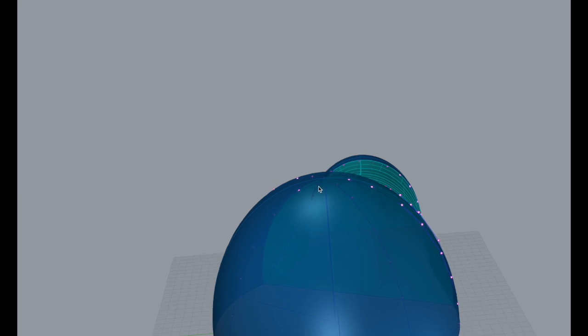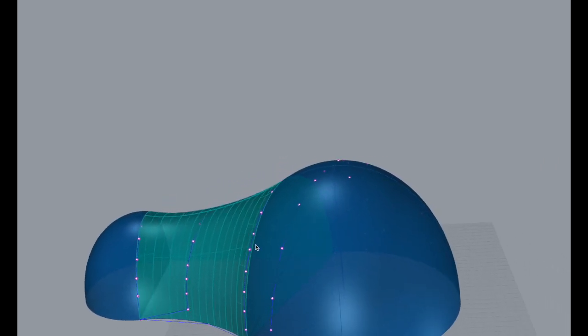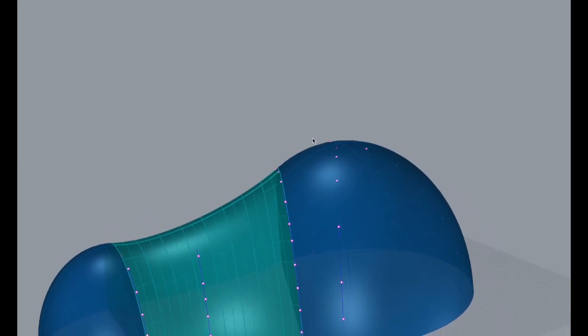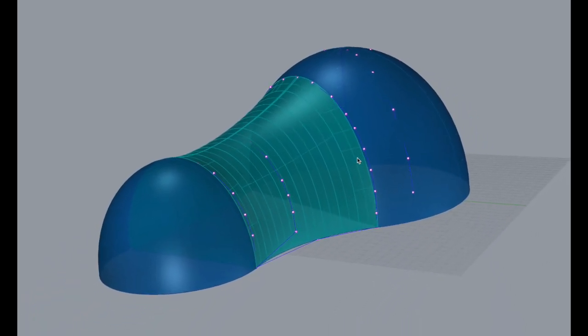So the top came down a ways and went kind of round. But then, here at the saddle connection, it really came down. So, yeah, it's exactly what they expected. So the baffles did their job. They kept that dome with the right shape.